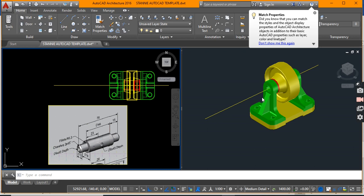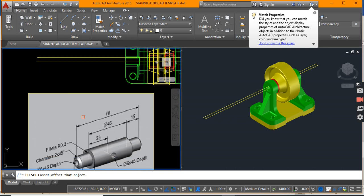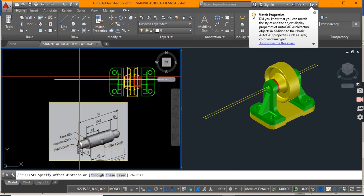We will remember that 18 is the size the bushing was made at. Let us go ahead and do offset. Our smaller portion has diameter 12 — remember this is our center so we're going to be using radius instead — so we're going to offset 6 millimeters from this line. Our larger diameter was 18, so let's also offset 9. That represents both diameters of my axle system.